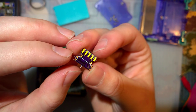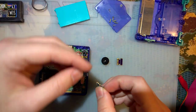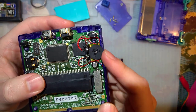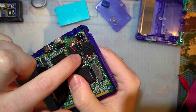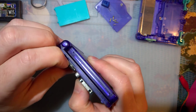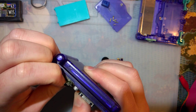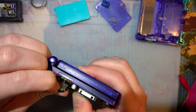As is usual with PCBs from OSHpark, they come with these little tabs on there. I did already go ahead and file them off on this one, so I'm going to use that one. Fire up the soldering iron. This is what I did to get that potentiometer working — there's a mess of wires. Not all of these wires are hooking this potentiometer up, but it's pretty much just held down with hot glue. I'm thinking we should be able to get it out of here relatively non-destructively. There's also some double-sided tape I tried using initially, but that didn't hold well enough, so that's when I opted for the hot glue.